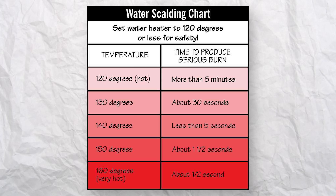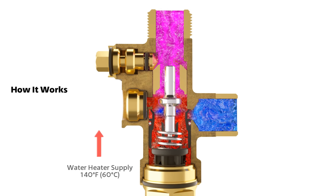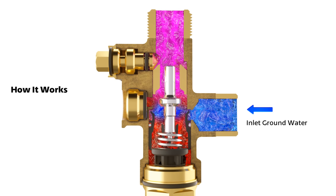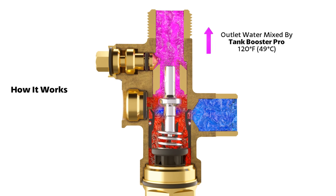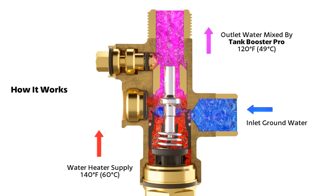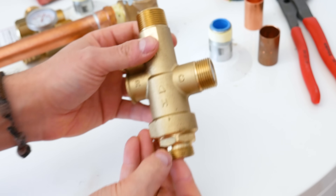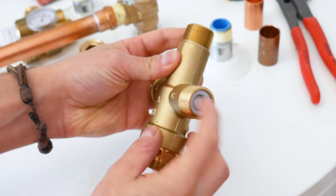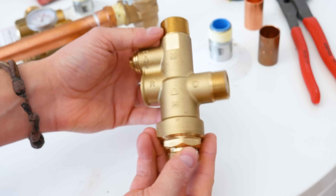The second function is to prevent scalding. You wouldn't want to set your tank's thermostat at 140 degrees Fahrenheit and use the faucet as a mixing valve, as there'd be a possibility of someone burning themselves if they didn't know. Here's a quick animation of how they actually work inside: the hot water goes into the mixer at 140 degrees Fahrenheit, mixes with the cold water feed, and gets distributed at 120 degrees Fahrenheit as it normally would. This keeps more hot water in the tank and less of it is used, which is why you'll save on hot water. Both the hot and cold sides have check or non-return valves, so there's no need to install separate ones.